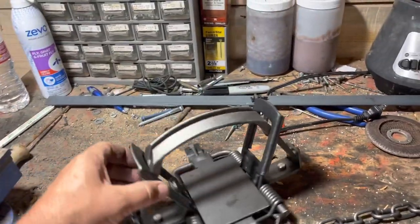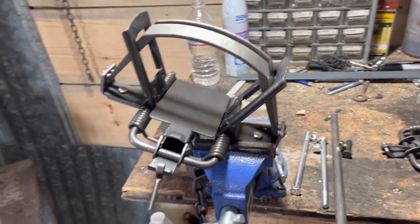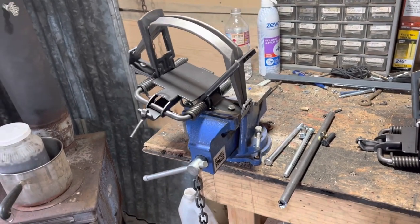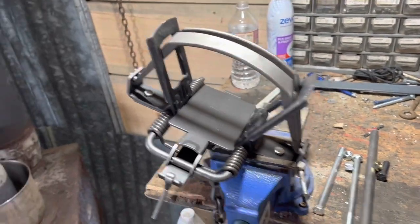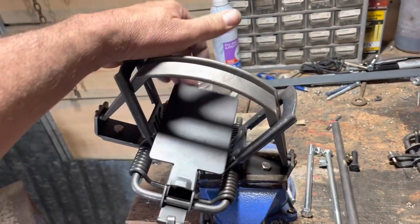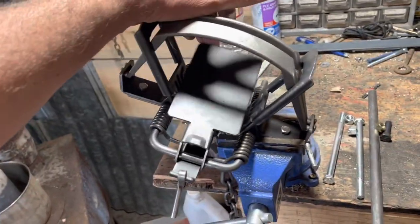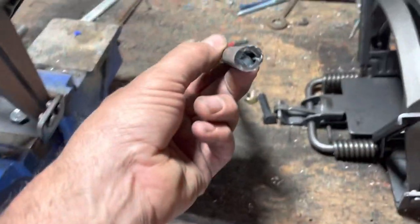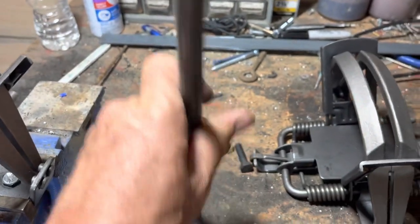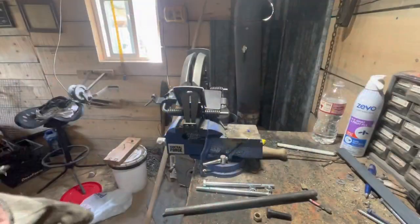That's what I'm gonna do with these traps. We're gonna modify it together — dismantle this thing. I like the design of the trap overall, but I don't like that big pan — that's bad news. We also got to make it legal in Montana, where we need to tighten the pan extension. What I've got here: some three-eighths ID round stock that needs to be cleaned up, fine thread hardened bolts, and some washers. Alright, let's pop these springs.